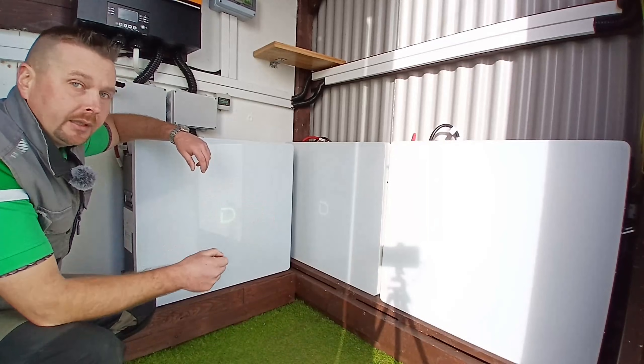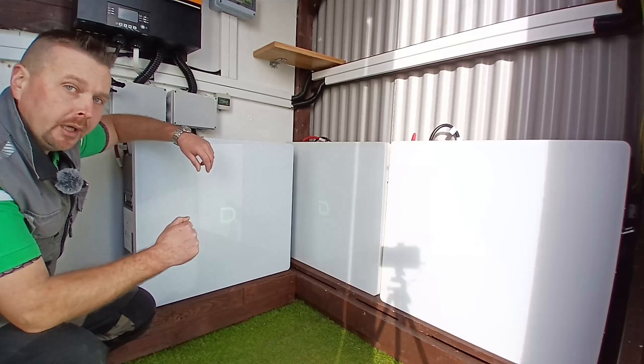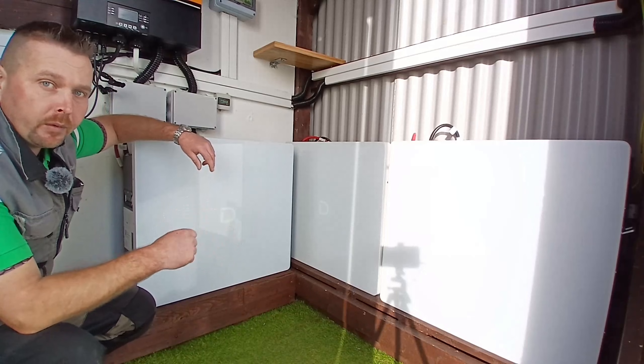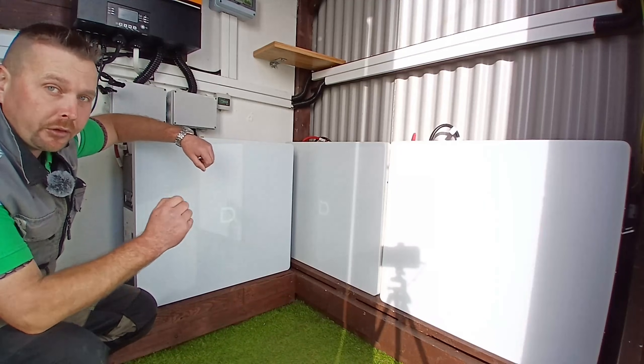Here's how it went. We are at 7.5 degrees. There's the electric shower on. The restart time on the inverter could be as long as about 180 seconds. The power is gone. With two batteries turned off and using only one for the test, it failed. At an ambient temperature of 7 degrees and an external temperature of 3 degrees, we put a 9.5 kilowatt load onto it, which adds up to 175 amps at 54 volts, when the max continuous discharge is meant to be 200 amps with a peak of 300 — and it failed.